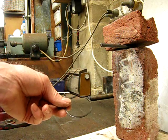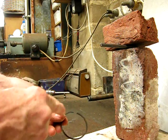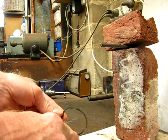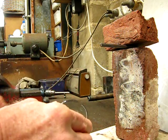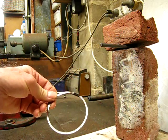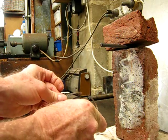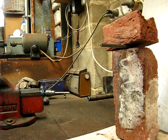It's as easy as that. Provided you do the heating evenly, make sure you try and get it red hot all the way around, and then give it one good burst at the end it will drop off, and that will be a perfectly good piston ring - equally as good as that commercial job. So there you go, a miniature one that you can see - proportionally they are the same. It's as easy as that.